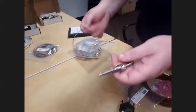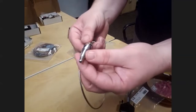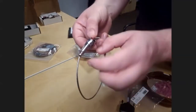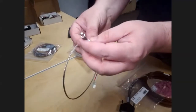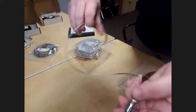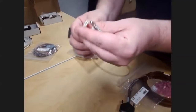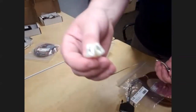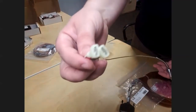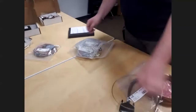So in most common aircraft, this threads into one of the ports on the cylinder head itself, and you actually adjust the height a little bit to where this probe is hanging out in the airspace right up against the cylinder, so you get an accurate cylinder head temperature reading. You got a short run of wire, foot and a half long perhaps, and then the two mating terminals to the connectors that come with the EGT CHT harness itself. So a lot of plug and play stuff here.